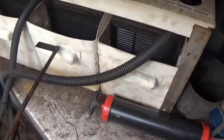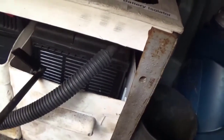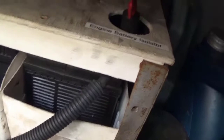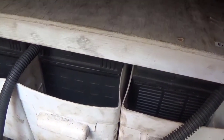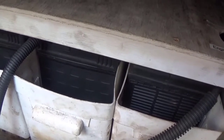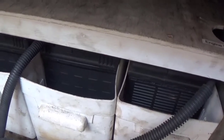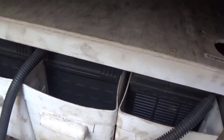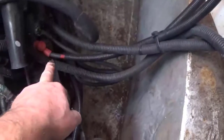The batteries are in these cases. That end is the starter battery, designed to crank a diesel engine. These are two deep-cycle batteries designed to be pretty much fully discharged without harm — they keep all our electrics going. They're connected in parallel, which I always thought was something you didn't do with lead acid batteries, but it always happens on boats so there you go. This is all the battery wiring — nice big fat wires for lots and lots of amps.